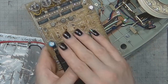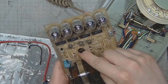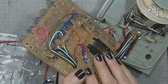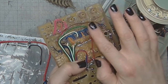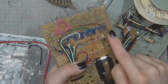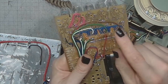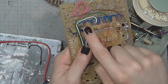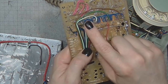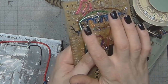And here we've got the Nixie board without the former mess of cables. We've got cables entering the hole and then routed to the integrated circuits. Those cables go to the latches on the D flip-flops, the 7475. Those cables go to the ABC and the binary-coded decimal inputs on the latches. This is the power wire, and this is the comma and sine wire.